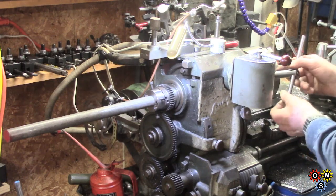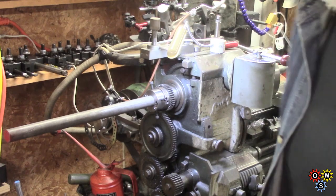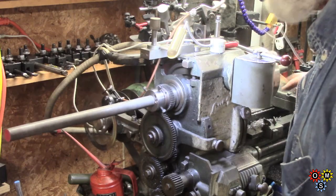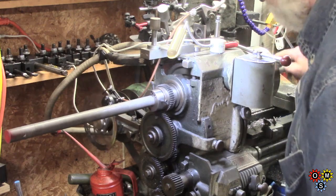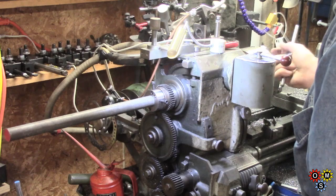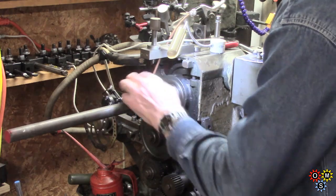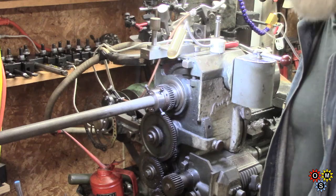There's probably about 4 or 5 inches sticking out from the chuck. That's now solid. Alright, so inch is my max because of the spindle bore, and that's okay, because more often than not I should think I'll be concerned with trying to support a longer piece of maybe 1/2 inch. I'll put a piece in a minute, see how it works out.